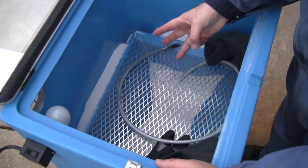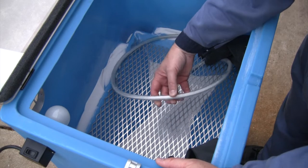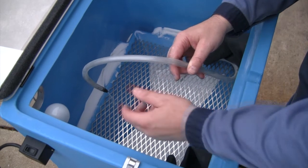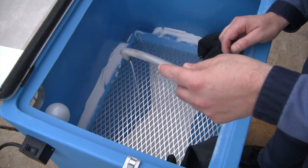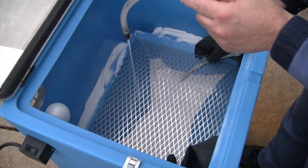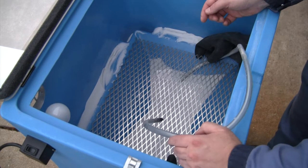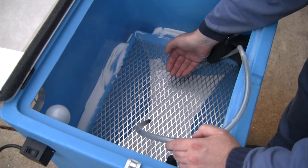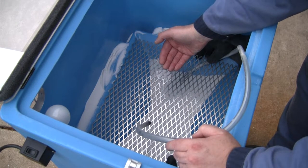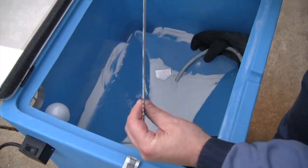Third time's a charm — we're going to see if we can get this working tonight. More feedback from Cyclone: since the media tube is completely filling up with media, that is not normal. It seems like it's not getting enough air. The suction is almost clogging the hose. So we're going to test it first by disconnecting the hose from the bottom of the cabinet and lowering it gently into the media at a 45-degree angle with only half the outer hose in the media, to see if that draws enough.